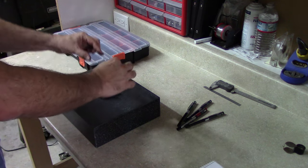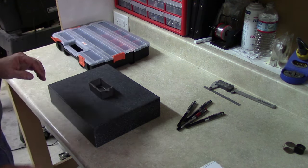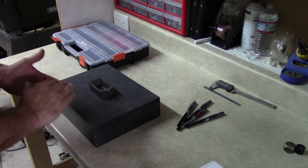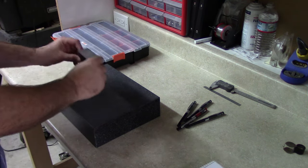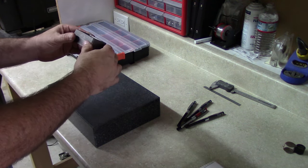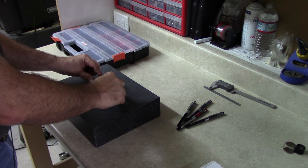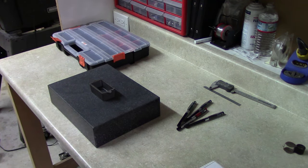And now when we clamp it down in the milling machine face down, flat against the block, and go through and plane this surface off, we will end up with two surfaces that are absolutely parallel to each other. And again, we're just trying to take enough material off of here to get a smooth, clean surface on the top. We don't want to thin it out more than necessary. And there were no dimensions for it, so we'll do that. Next question is how to clamp this down.